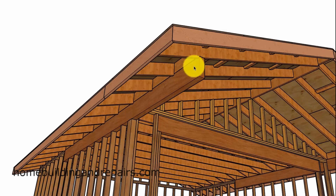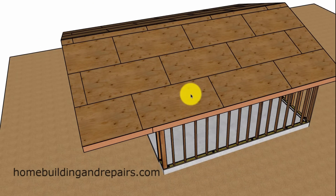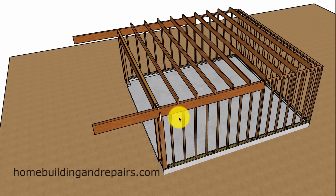Another view of it. Here we can see the beam going all the way — it's built into the wall. With the sheathing removed, you can see the fascia board, rafters, and the beam. You can see here with the beam I've got a couple of straps on it sticking out. Remember the one-third out rule — this is six feet and this is 12 feet.